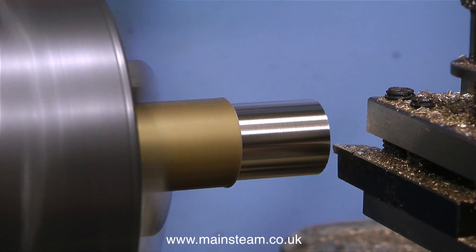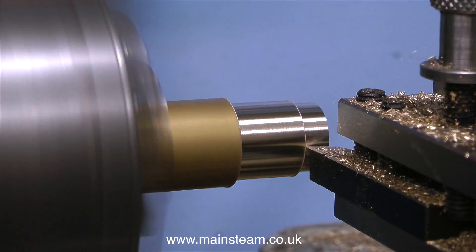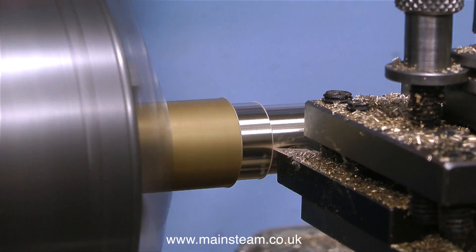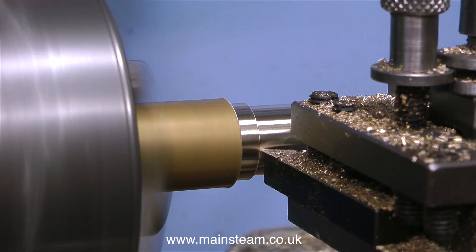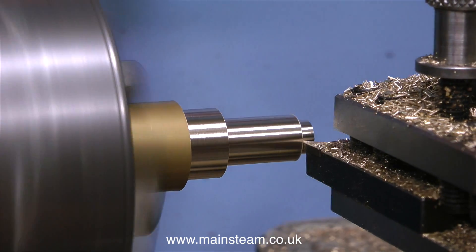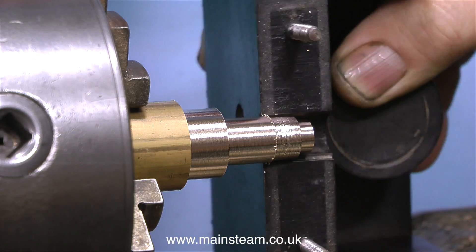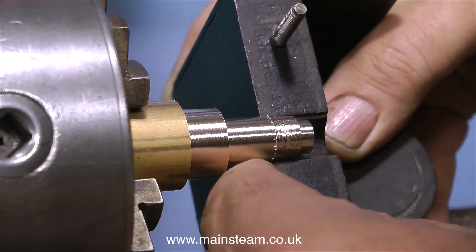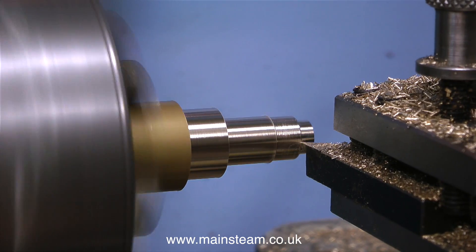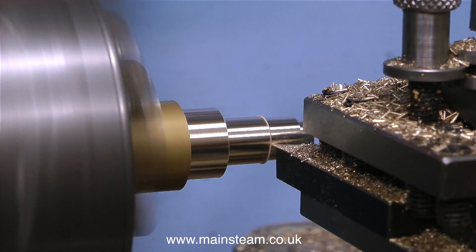It's a simple plain turning job. What I'm doing at the moment is turning the outer diameter so that it fits inside the threaded area of the burner head. I don't need to thread this part and I don't have a die of that size anyway. The main diameter of this adapter needs to fit in the gas burner holder. The easiest way to make sure it fits is to offer the holder up to the adapter whilst it's in the lathe and see if it fits. Once I got the correct diameter I machined the brass all the way down so it fitted in the holder.